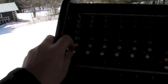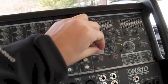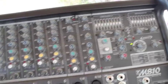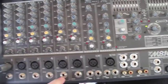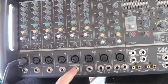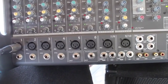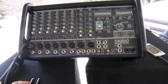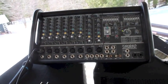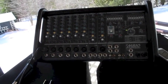Your mains is the white knob right above your trim knob, and you're going to want to turn that about halfway up and go through the exact same process. One other cool thing is you can run a piano or a guitar straight into your board here on channels 5 and 6 without using a DI box or anything, which makes it nice and easy. For DJing or something where you need to plug in your iPod, your computer, your phone — whatever — this is the easiest way to show you.